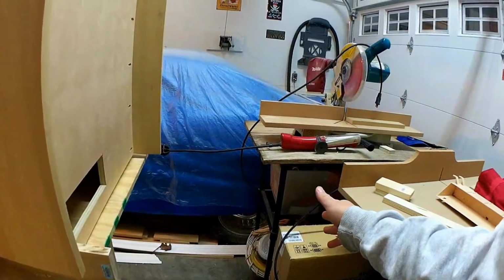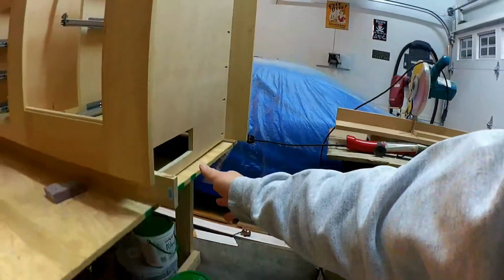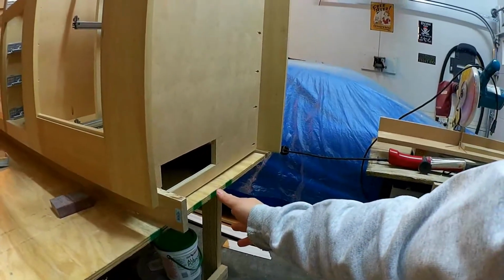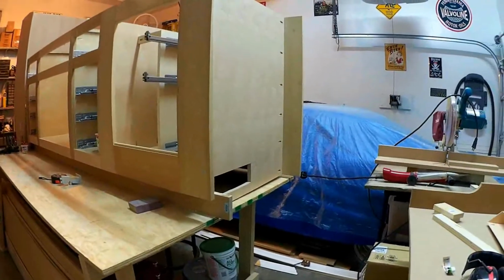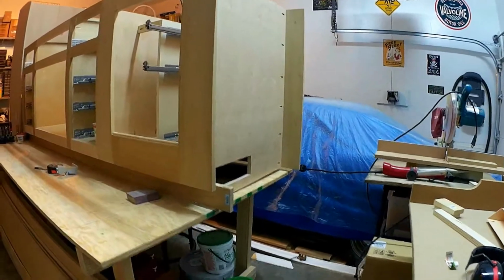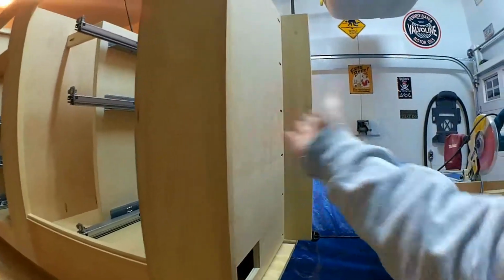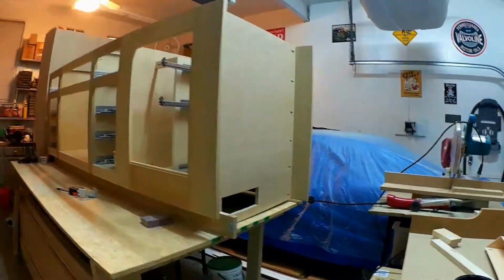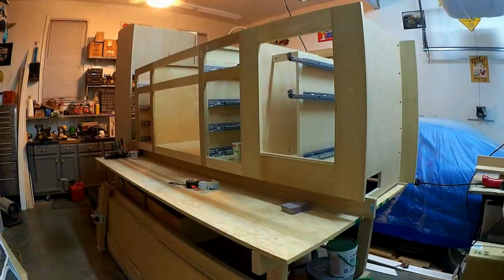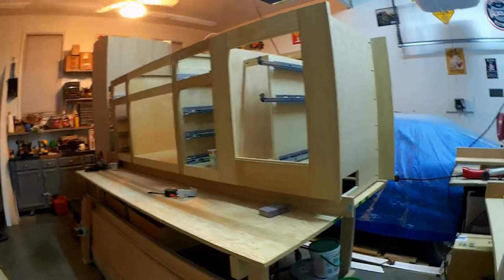To do that, I didn't know if I could go straight outside or if I would have to come up some before I went outside, because on the back side of my kitchen I have a deck, and I didn't want to run into the rim joists of the deck with the exhaust vent port. So I wanted this a little bit deeper in case I needed a 90-degree up and then another 90-degree out. I'm hoping I don't have to do that, because the directions for the exhaust fan don't recommend too many 90-degree turns, since it reduces the effectiveness of the fan.